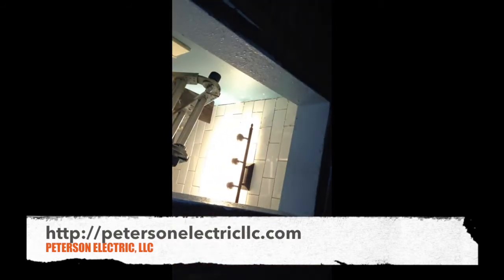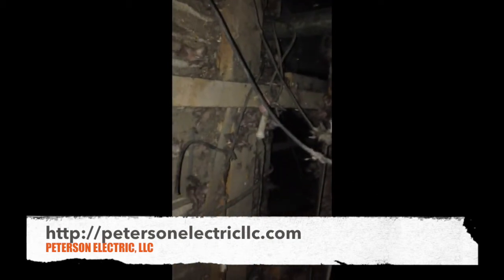You're supposed to cut out your old knob and tube so people know what's going on with any old wire — and it's not. I got up here thinking all this stuff was hot; this part's dead. It's going across the whole attic. There's your blue wire — that does a switch leg to that light right down there, probably 1960s. Here's your old service mast — they moved the panel over to a bathroom. Look at this rat's nest. I won't tap anything on knob and tube — I don't give a crap what job it is. I'll go find a cleaner, safer job.